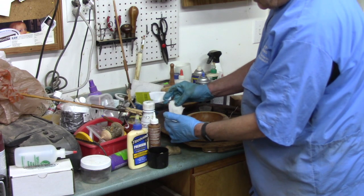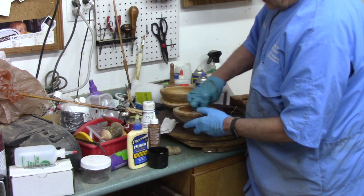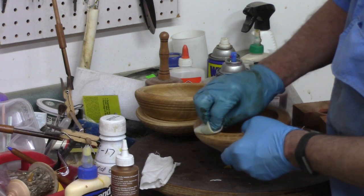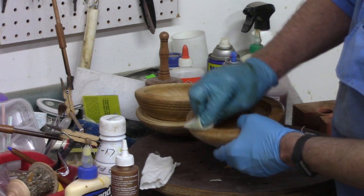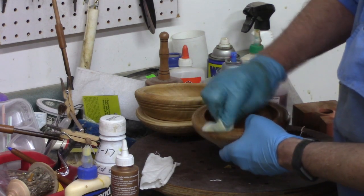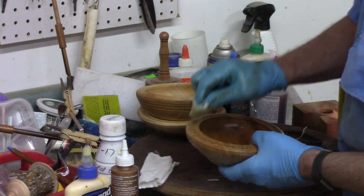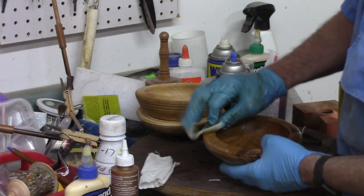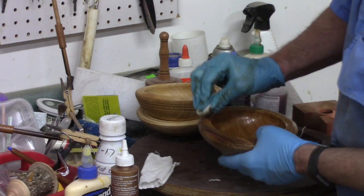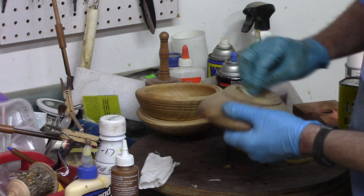It's just a little more work to tear and cut them. I'm going to take this and just liberally rub it in. I just blot the finish into this textured ring I have with some torn, ripped-up grain. The finish absorbs more into that torn grain, which makes it darker, which is nice — that's kind of what I'm hoping for. I could use a paintbrush for this, but then I'd have to clean it or waste 50 cents on a chip brush.